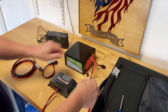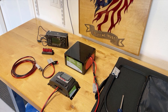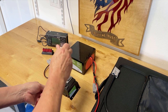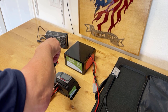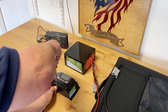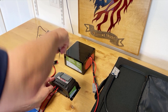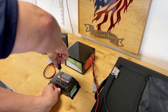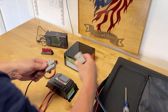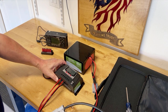All right, we can actually connect our battery now — and you can see that we've already powered up. Next we're going to connect our cable for the solar panel, and again we're going to start with connecting at the charge controller, making sure that our polarity is correct. There we go. All right, and now we can plug into our solar panel. Nothing is going to happen right now because our solar panel is not in the sun, but we're showing you the connections and then we'll take it out into the sun.